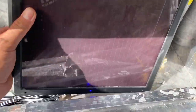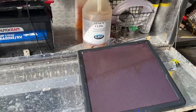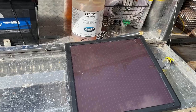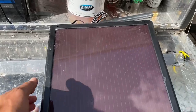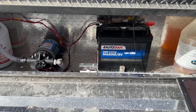One thing that I did do on this one, which is a little bit different, is a solar panel. These batteries are not connected to anything — obviously there's no alternator charging the battery. So when this unit is in use, our techs can just pull out the solar panel, set it up on top, and it will help to maintain and charge the battery as we are using the power from the battery.